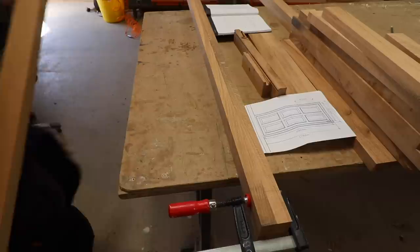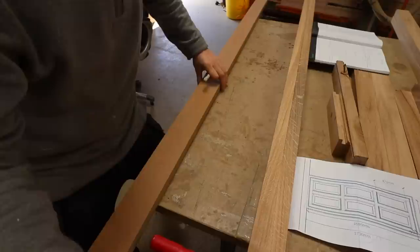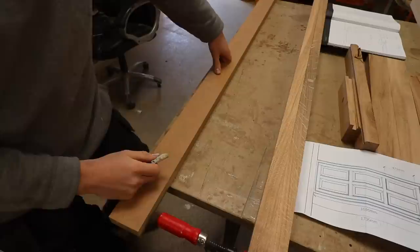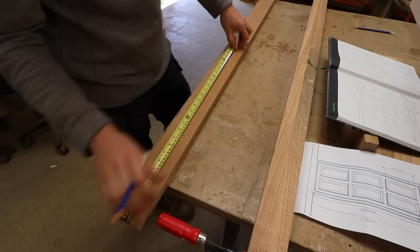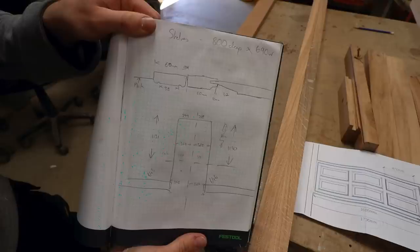Right, so instead of doing this off measurements, because we're filming it and trying to instruct you in the techniques of bench joinery, let's do a rod drawing, and it's a cross-sectional drawing of the item that you're going to make. It's very important to set out your joints and know exactly how it's going to fit within the project.